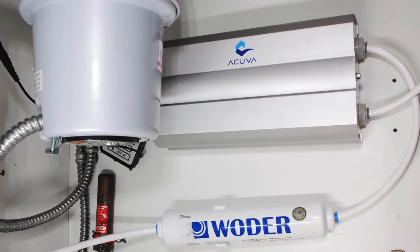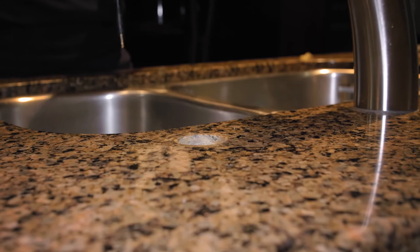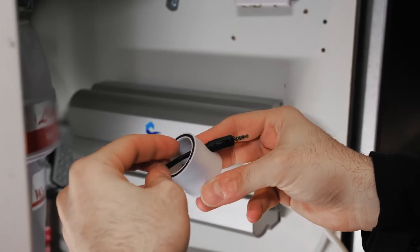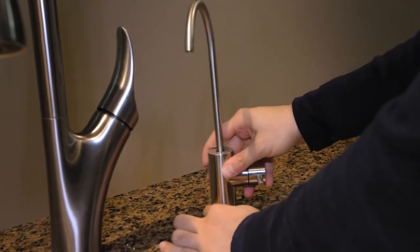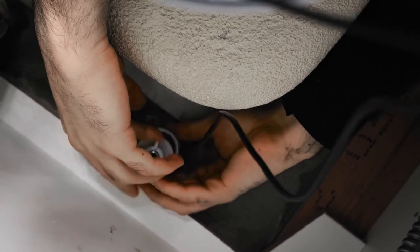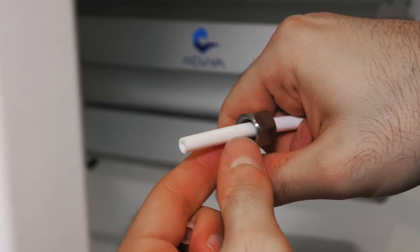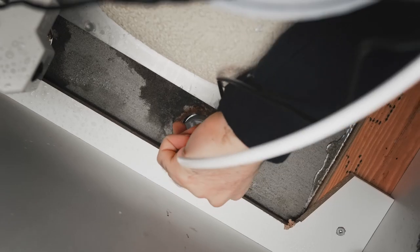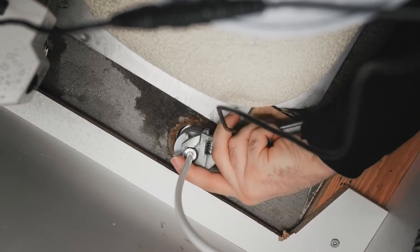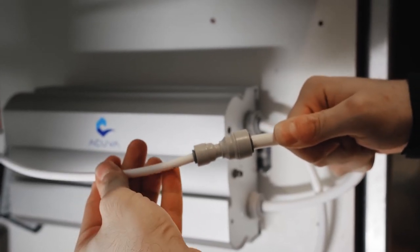Next, we'll start installing the Acuva Smart Faucet. If there is not already a hole to install the Smart Faucet, you will need to drill a 3/4-inch hole into the countertop. Once you have a hole for the faucet, thread the faucet cable into the hole followed by the faucet stem. Under the counter, thread the faucet power cord through the plastic spacer, making sure that the O-ring seal is facing up so it seals against the counter. Make sure that the faucet is positioned properly before securing the plastic threaded fastener into the faucet stem, then tighten the fastener against the spacer to secure the faucet into place. Cut a section of 1/4-inch tube and slip on the hex nut, followed by the plastic ferrule and plastic tube support as demonstrated. Tighten the hex nut to the threaded rod of the faucet by hand before tightening with a wrench. Cut a final section of 3/8-inch tubing to connect the Aero with the Smart Faucet, and use the straight reducer adapter to connect the 1/4-inch OD tubing to the desired faucet.